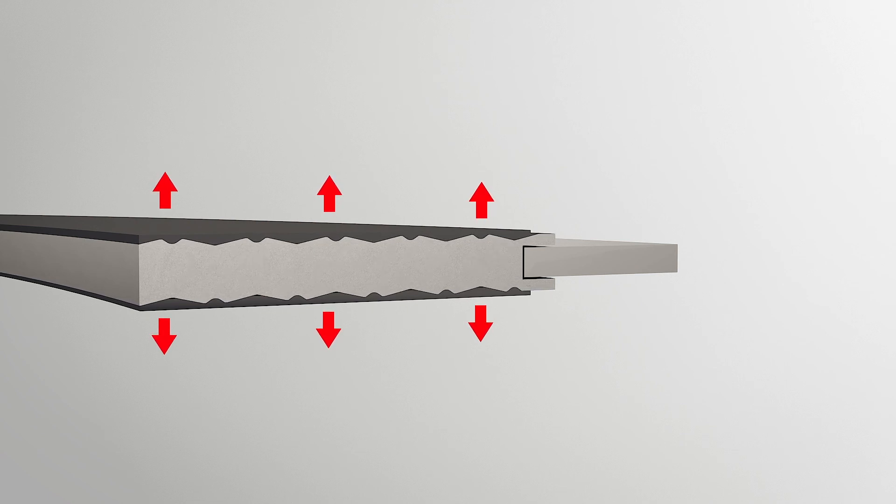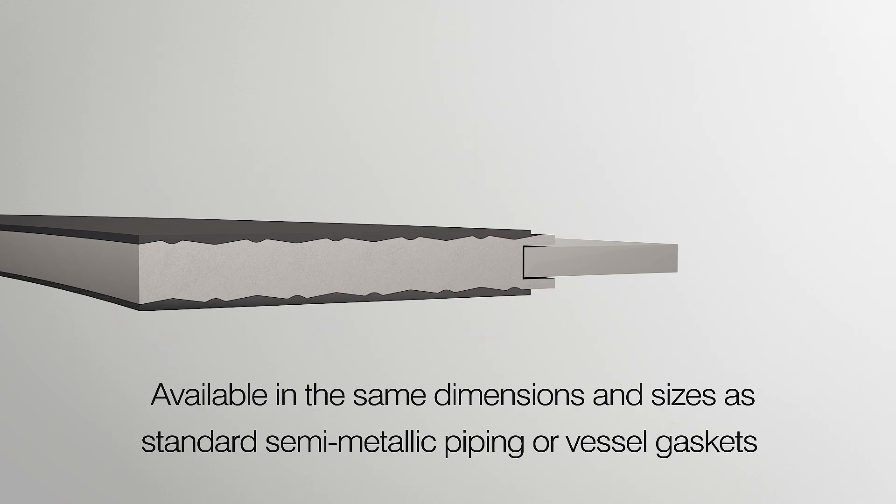However, with Activate, the metal core with its unique asymmetric groove design provides high elasticity and recovery characteristics as well as an improved gasket deflection profile. This is of great importance particularly when operating conditions fluctuate due to thermal transient conditions or flange rotation.